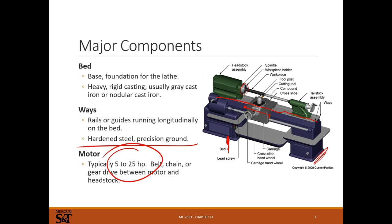The main safety practices: mainly long clothing and long hair - anything that can get wrapped up around the spindle is what you really need to avoid. If you have your sleeves rolled back, your hair tied back, and nothing that can get caught in the machine as it goes around, the kinds of injuries are very limited and usually very minor - you might cut yourself, break a finger, or throw a chip and lose an eye if you're not wearing safety glasses. But those are relatively minor compared to getting pulled into a five-horsepower machine. There are a few basic things: if you follow them, these aren't unsafe to run. There are certain precautions you just never skip when using a lathe.